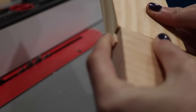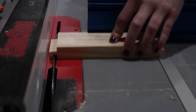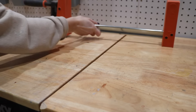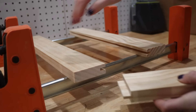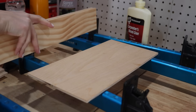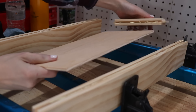I had to dial in the tongue thickness on a practice piece, but there are some really awesome videos on YouTube explaining how to do this — my friend Jason Bent from Bent's Woodworking has an awesome video and I've linked to it below. The coolest part about this form of cabinet door is that it requires absolutely no hardware — it's just joinery and glue. Once I was done cutting all the pieces it was time for the glue-up, but first I had to cut some quarter-inch plywood at the table saw to make the panels for the cabinet doors. Following that I was able to glue everything up and make four cabinet doors.